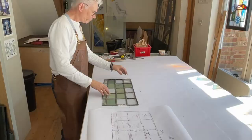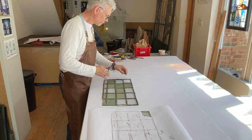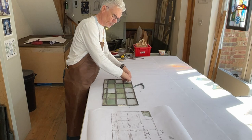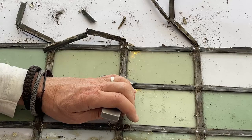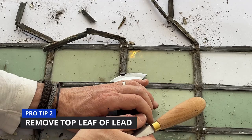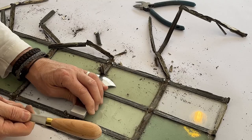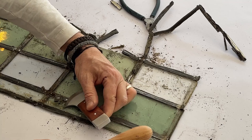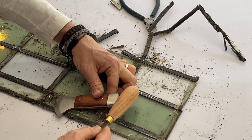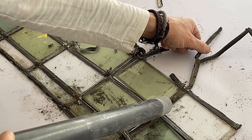Obviously take photographs as well as a little aide-mémoire. Let's start carefully taking the panel apart. Because this is 18th century glass in some parts, we have to work very carefully because the glass is thinner than contemporary glass — sometimes only two millimetres thick compared to the normal three or four millimetres. A useful tip is to take the top leaf of the lead off very carefully, as I'm showing you here. This allows you to dismantle the window carefully without stressing the glass, keeping the minimum amount of stress on the glass as you're disassembling it.